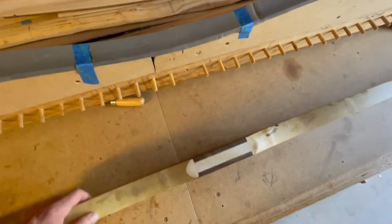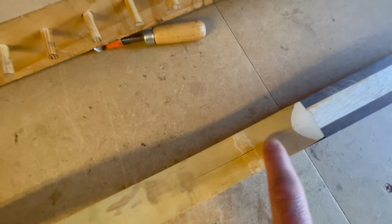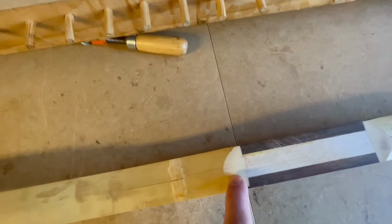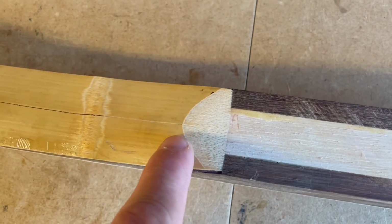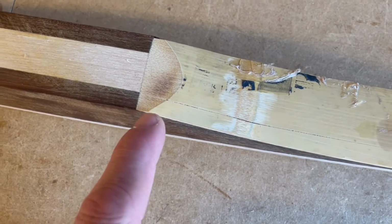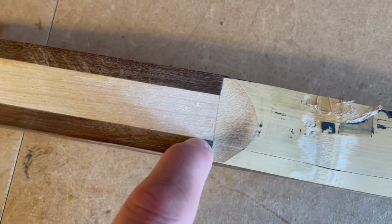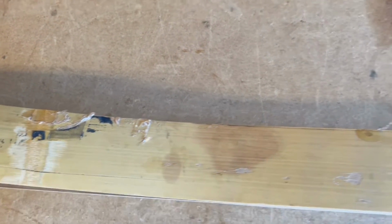I did mention that when it initially came out we had some cracks going on. I still have the longitudinal crack, and you can see that crack extends all the way up into the exposed portion here, and does not really go all the way through. So we should be in pretty good shape with regard to this. It looks like this one actually did split all the way through to the glue line surface, so we're really going to have to watch this one.